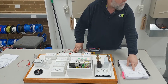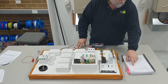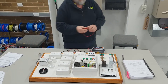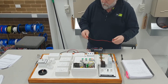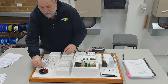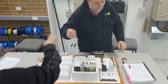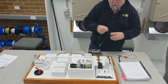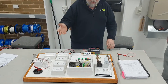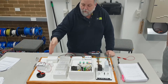The fan here is an appliance that won't be part of the hard-wired circuit. I've checked all my stuff - I'm happy that all earths are continuous. So I've done these two tests and satisfied the results. The third test is the insulation resistance test of the whole installation. We're going to clamp the active and neutrals together.